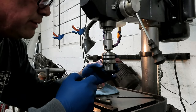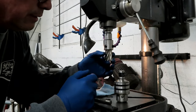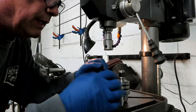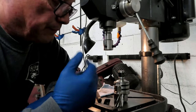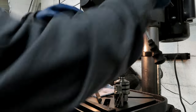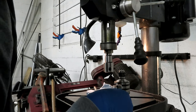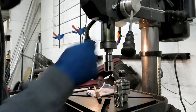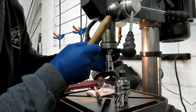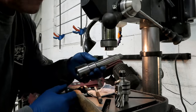The annular cutter just goes in that easy — that's all there is to it. Thanks for watching this video, I hope you learned something today. That's the purpose of these videos — to share things with each other. If you want to take this back out, just turn the slot so you can see the top, pop the wedge in, grab your hammer, and just tap it a couple of times — it comes right back out.